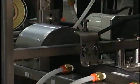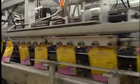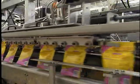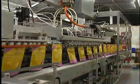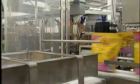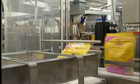After filling, pouches travel through a de-duster and then move to the top sealer and cooler. The sealer-cooler unit travels with the pouches to ensure a top quality seal, and because the unit moves with the pouches, it allows for additional seal time. After sealing and cooling, the pouches go through a discharge area that removes them from the clamps and discharges them onto a takeaway conveyor.